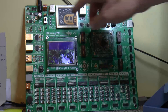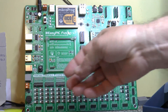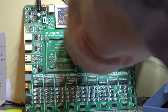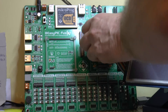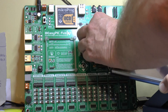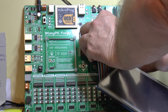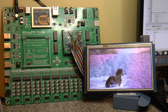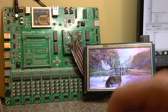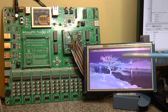Now you've seen how slow the MX is, I'll swap to the PIC32MZ — this is the 2048 ECH124, so the 124-pin — and there we have the big pictures on the 7-inch TFT. This is only running in 8-bit mode at the moment, with reference to the Peripheral Pin Select which I'm going to show you.